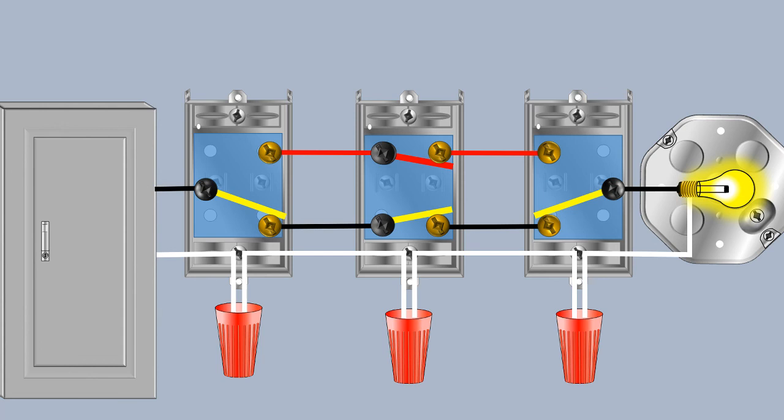So hopefully this video has helped sort out some three-way and four-way switching. Like I said, the previous video dealt with three-way switching primarily, but this one we just added that four-way. And again, you could have the exact same scenario — you could have 10, 20, 30 switches if you really wanted to in between those two three-ways, but those outside switches always have to be three-ways in order for this configuration to work. Okay, so hopefully this has helped. Thanks for watching, and we'll talk to you next time.